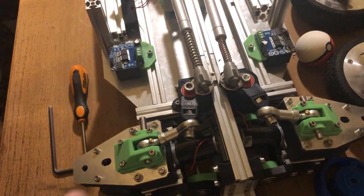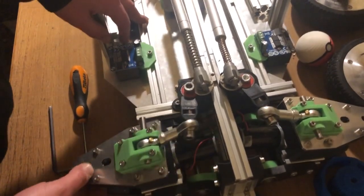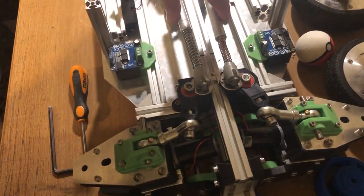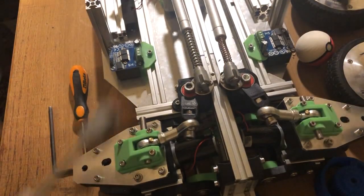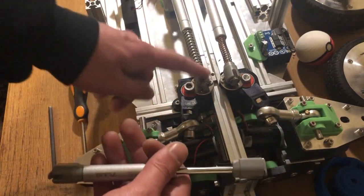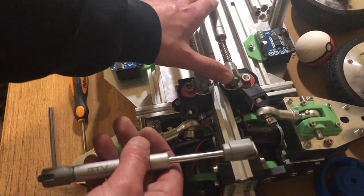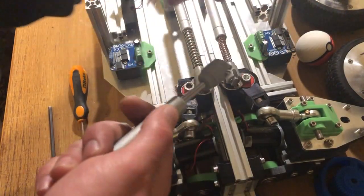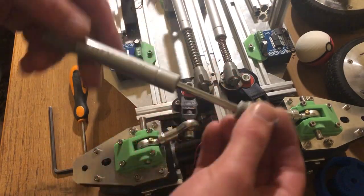That's all we have time for in this video. You can see that the suspension has come in nicely - we're getting there, it just needs a little bit more fine tuning. These dampers here are 50 newtons. I've got some 80 newton ones as well, which in the previous configuration were a little bit too strong. But I think now that we've got these shortened arms and no gears, we could put these smaller ones back on. They're a lot harder to press down, the spring fits in there better, and they take up less space - so they're better all around.